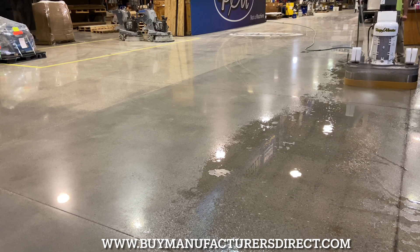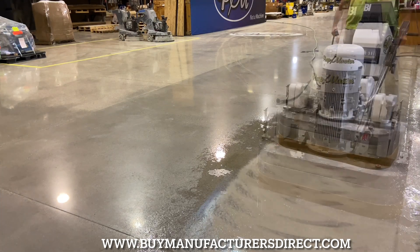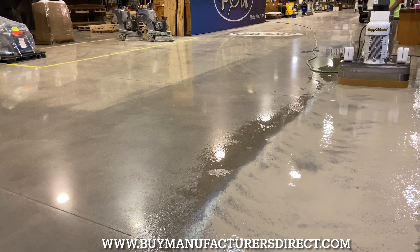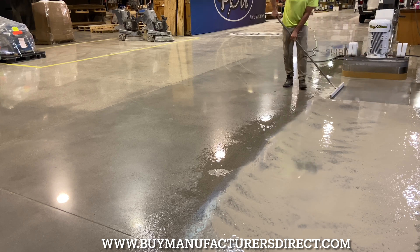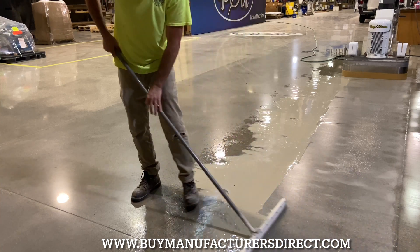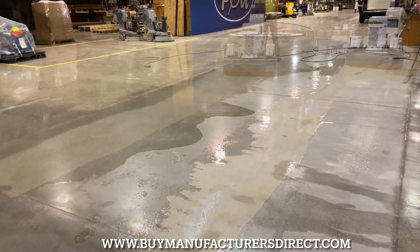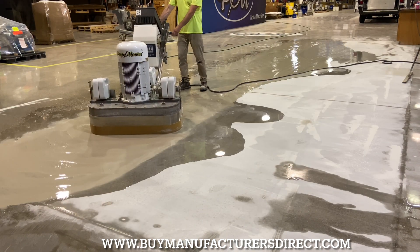Most professionals would agree that wet grinding and polishing leaves a preferred aesthetic result. However, those results come at a cost. While wet polishing shortens the overall polishing process, extends the life of your diamonds, and improves the refinement of the surface, it does require special equipment and waste disposal. If a customer is in search of the ultimate polish, the extra effort of wet typically outweighs the results of dry.